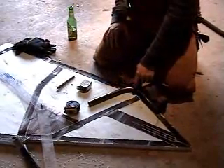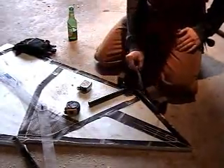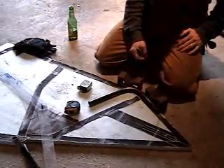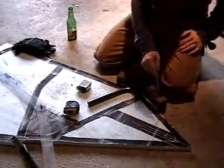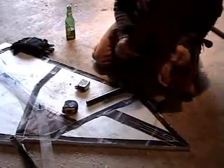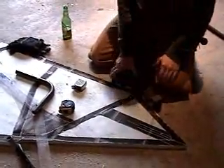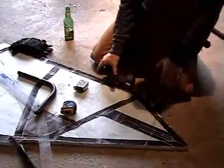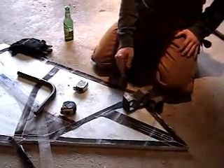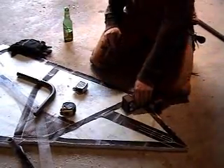I'm going to slide it back until the tubing intersects with the face of this V-block, squishing it down so the face of the V-block is completely touching the face of the tubing. At which point, I'm going to mark on my paper template with a silver Sharpie the black line off of the tubing. That tells me where to line the beginning of my material up in the bender. I'll then take my second V-block from the left leg of the paper template and set it up so that it is perpendicular to the left leg, and scribe my line all the way across the paper template.